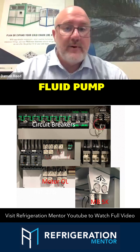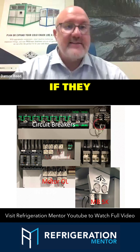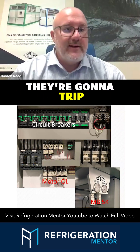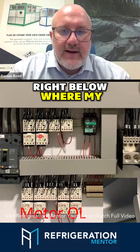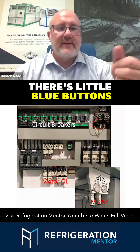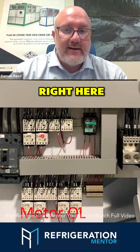We're just monitoring fluid pump motors and those overloads are set up. They're bimetal resistors inside. If they sense too much amperage for too long of a period of time, they're going to trip and they're set up for a manual reset. There's a reset button right below where my cursor is showing now — the red dot. There are little blue buttons. If they need reset, there is a trip indicator under the plastic piece right here.